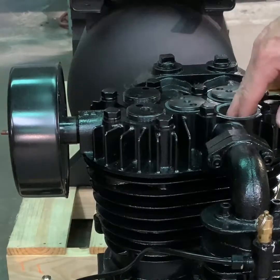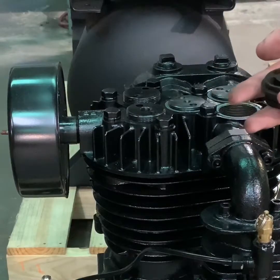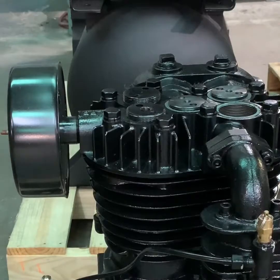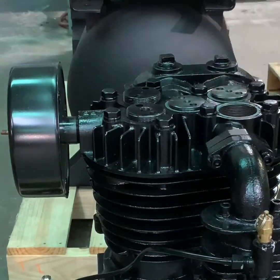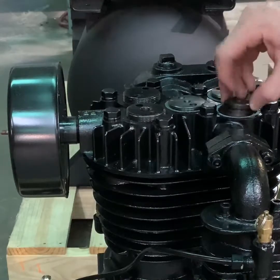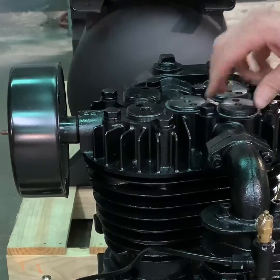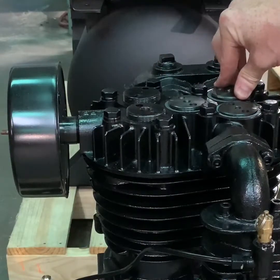Once you remove the valve hold-down, we can remove the valve retainer. Once the valve retainer has been removed, the valve can simply be picked up out of the head of the compressor pump. There is a copper valve seat gasket that, if needed, can be replaced as well. To put the valve back in, simply put the valve copper gasket back on its seat in the head, then insert the valve back into the head of the compressor pump. Replace the valve retainer ring and put the valve cap back in. This step is repeated five times for all the valves.